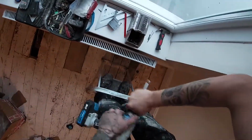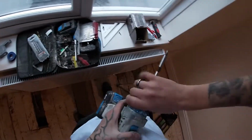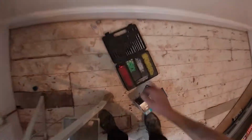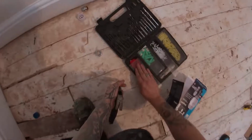Okay, let's start drilling. That went in nicely. Okay, let's change to Phillips number 3, speed 1. Now we need 2 red, 2 whites. So one in here, one in here, here and here. Be gentle with plugs. Hit them a few times more, or lighter, because if you strike them at once, they'll just bend. Now, 2 reds.